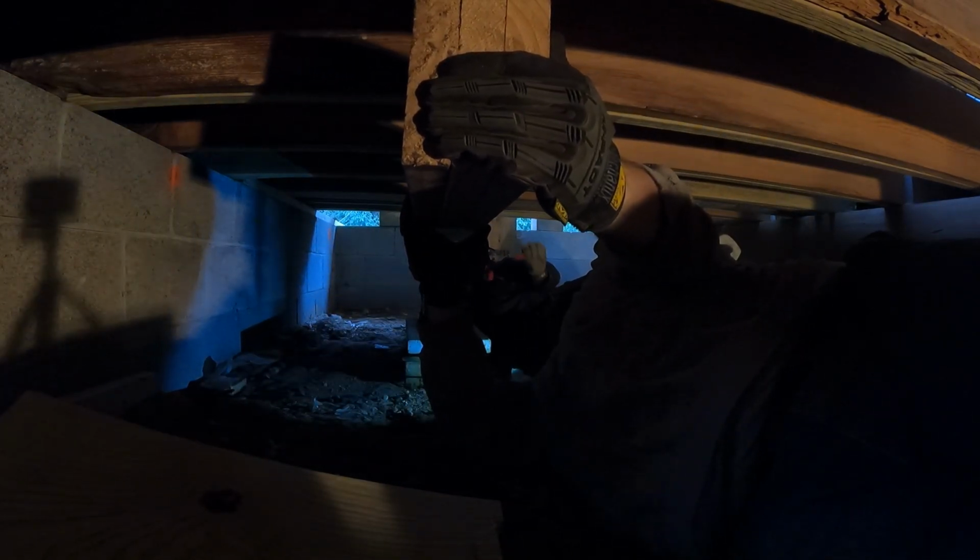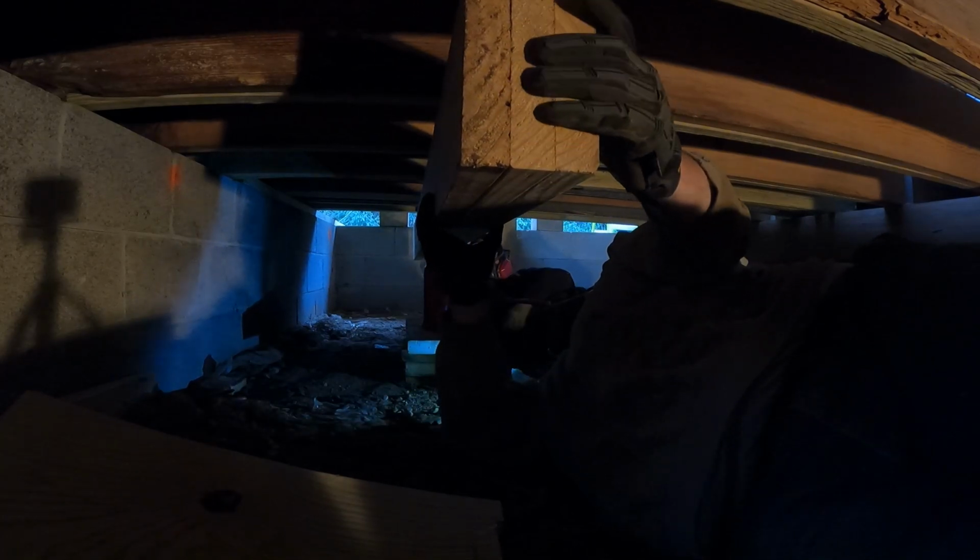It's only maybe a 1.5 inch diameter circle, the top of the jack, and it was pushing into the wood. So instead of the house going up, the jack was just crushing into the wood. So now there's a 1/4 inch steel plate on the bottom of that board, which should keep it from pushing into it. If we start breaking a 1/4 inch steel plate, we got way bigger problems. So we're just going to lift this up to try to get some more sill in here.